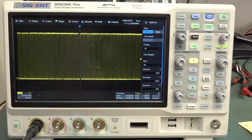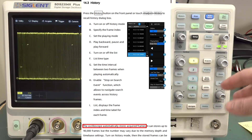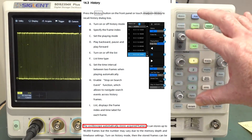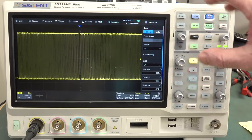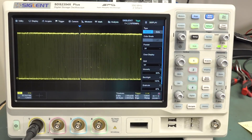As far as I'm aware, please correct me in the comments below if I'm wrong. I've looked at the manual and it's not really clear — it does imply that history mode is always there, but it's not really explicit. They're certainly not clear that you're trading off that 200 meg of memory. This appears to be a Siglent thing and a LeCroy thing specifically.